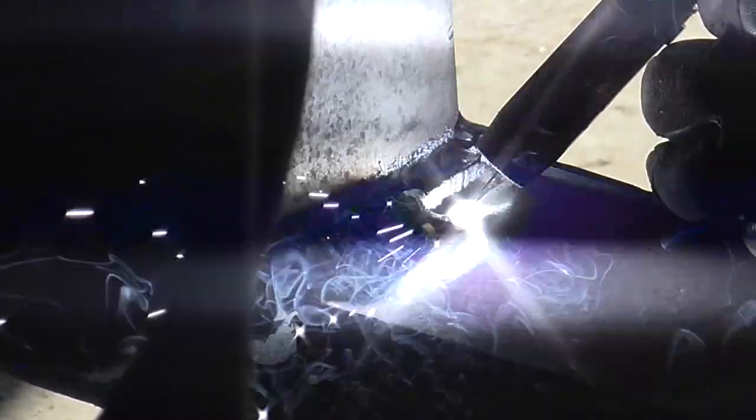So he's working his way, filling all this in one shot. If you've ever welded something like this with a spool gun, then you know how the spool gun just gouges and lances the material off the sides and just burns it and makes the gap wider and does not really allow it to fill. The pulse MIG machine just gives you the power to control the heat perfectly and fill these gaps in a single shot. If you want to do a nice cover layer over it later on, you can do that too. You may not even have to do this.